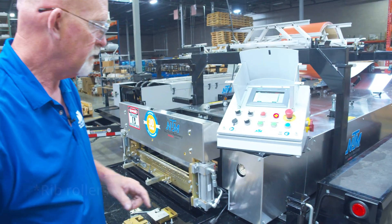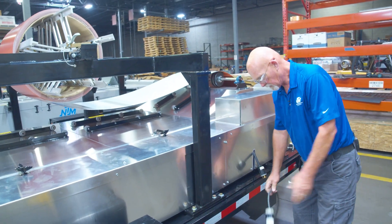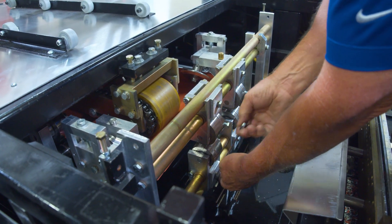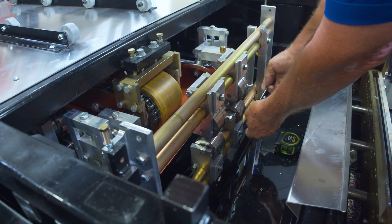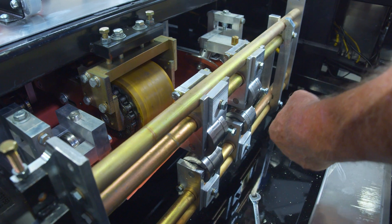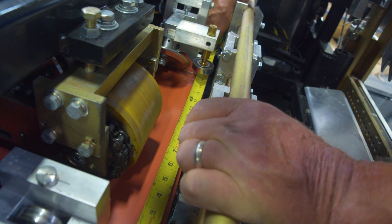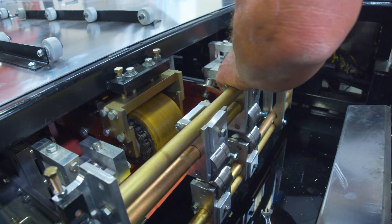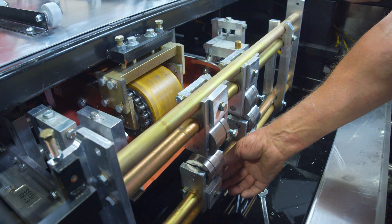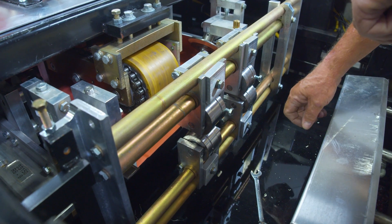We're going to turn this off, unplug it, turn the power off. That way when we stick our hands in there we're not going to have issues. Let's loosen them all so we can move them around. These are your adjusters here, and then the pressure adjustment is this bolt right here — we're going to play with that too, because right now I've got it set in no-bead mode, backed all the way out. Let me take a measurement down here. It should be about right there, and after I adjust that I go ahead and line this up. An easy way to line these up is just line the edges up — either the rollers or the side of this — and you'll be really close to having your beads set up properly.